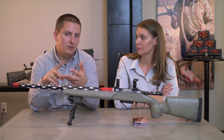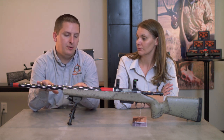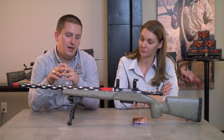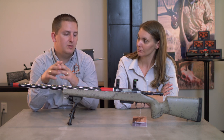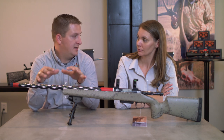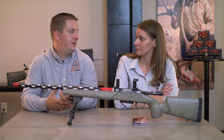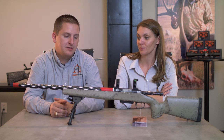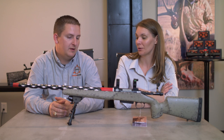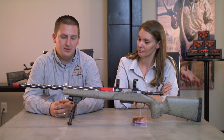What I've seen visually is that when you pull the rifling through the steel core — whether you do a button or cut rifle barrel — you've added tension to the material. When you go and flute that barrel, you'll see the barrel give back to a more natural position. People say fluting will move your barrel, but it's actually just releasing some of that tension. A barrel that doesn't have as much tension in it is actually a little more repeatable — it goes back to the same spot every time it heats up. Consistency is everything when it comes to accuracy.